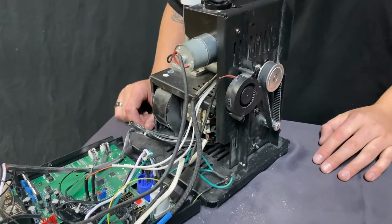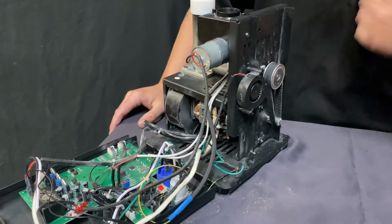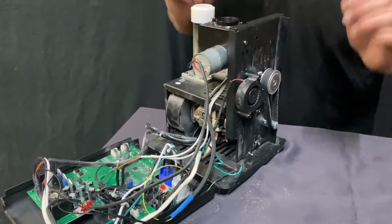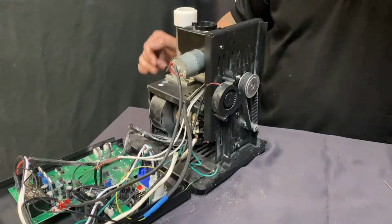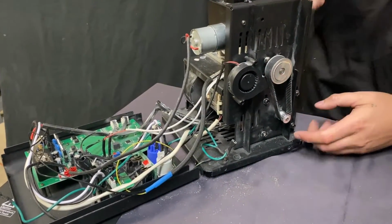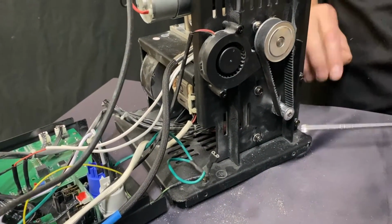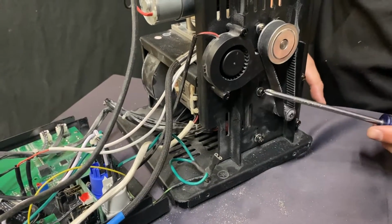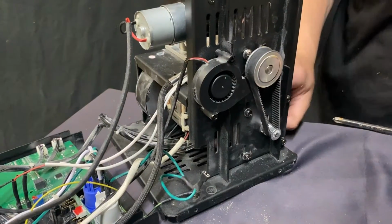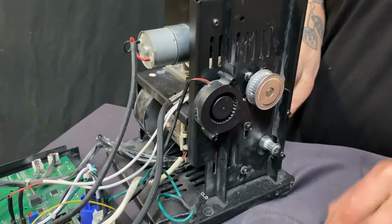But while you're at it, might as well talk about opening it all the way up and going inside. Link below in the description how to clean the actual heating element and how to repair it. But covering the basics here just for this video, what you'll do is you'll go ahead and these screws, you'll loosen, let me get my pointer here, which is a handy screwdriver. 1, 2, 3, 4. You'll loosen these screws. You'll push this down. Well, actually, it would already be down, but you would go ahead and push this up, and then you would take the belt off.